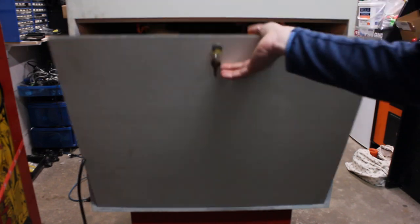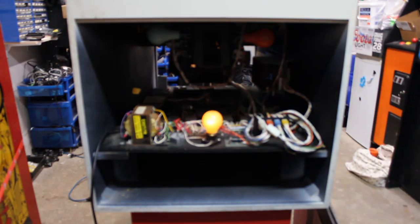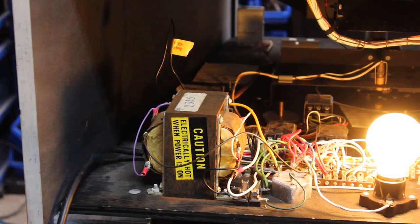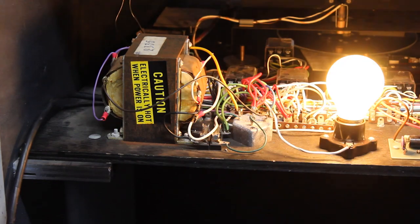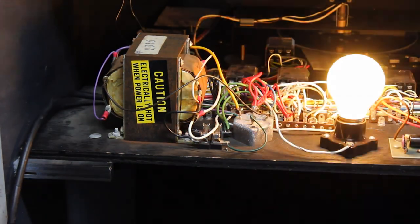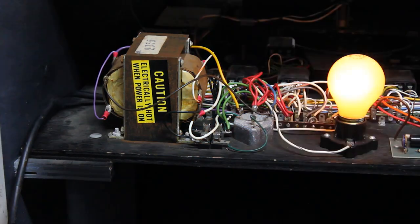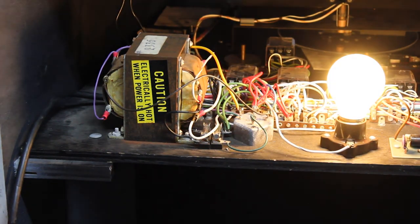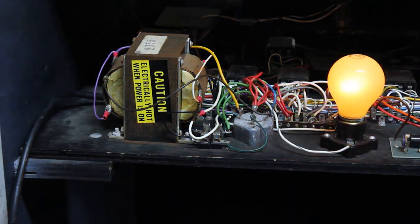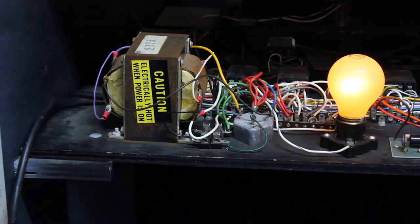Here in the back of the machine, you'll find various things, including the transformer. Worth noting is there is at least 2 different types of transformers used in this machine, across the number of games they made. One of which is listed on the schematic, the other is completely different. So the transformer on the schematic has 6 lugs listed. This one has, I think, 12 lugs. Some of which aren't used, some of which are connected to each other.